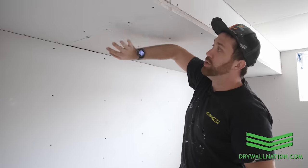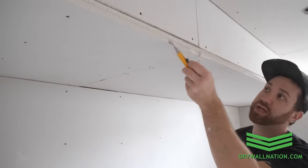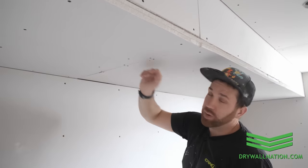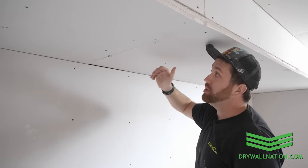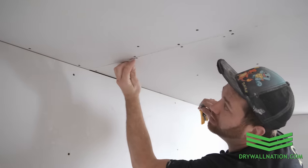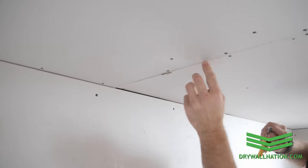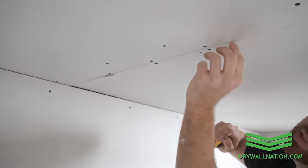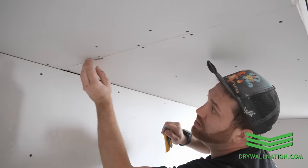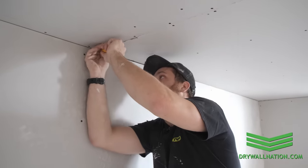This is a good example of what a conventional butt joint looks like. We had to do double-layer five-eighths because this was a fire-rated assembly, so we weren't able to use butt board like we typically would. You can see up close the kind of delamination that happens along the edge of butt joints, and the little humps it causes. This joint is already humped from the gypsum delamination, and that's why it's important to v-groove your butt joints.